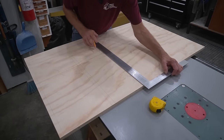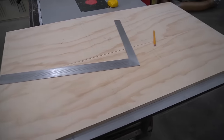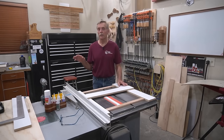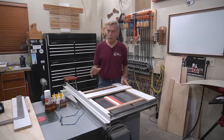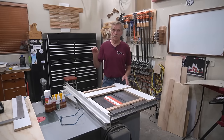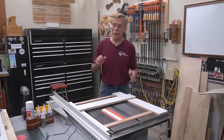Once all the predetermined shelf location marks are made, I square those marks across both side panels for the cabinet for reference when I route the stop dados for these shelves. Most of what you've seen so far is particular to the specific cabinet I'm building — just a storage shelf for a mechanical room — but now I'm getting to the crux of the video: a quick and simple jig for routing stopped dados that you can extrapolate to any shelf or cabinet.